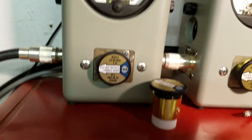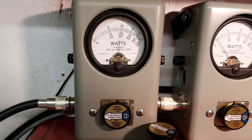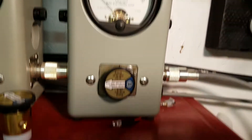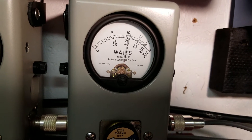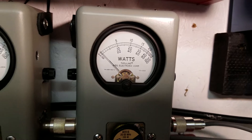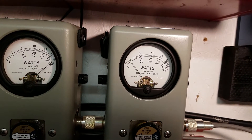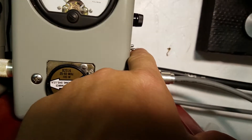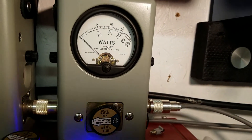Power all the way down — 5 watt slug, right about 5 watts all the way down, just in case you're gonna run an amplifier. 100 watt slug, 40 to 42 watts all the way up. We're gonna roll it all the way back down here to the 5 watt mark, go to peak power position — that's gonna read on a 200 watt scale.